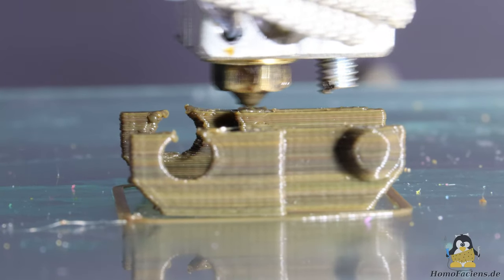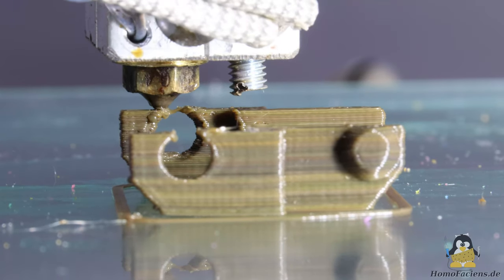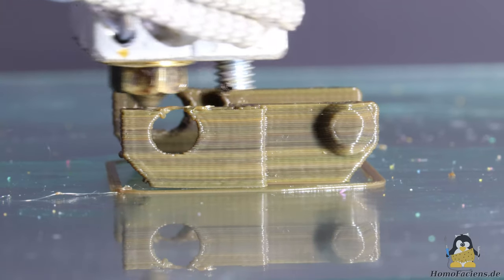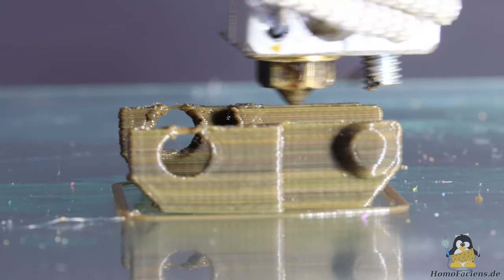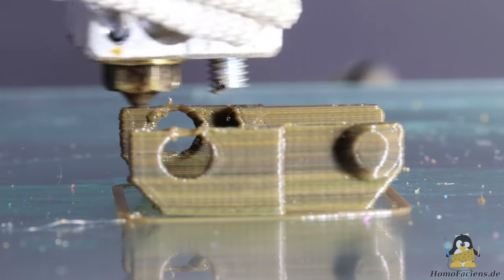The relatively soft plastic parts of my extruder are also helpful at the moment. You can see from the retract behavior whether the new extruder really works with lower forces, and that is obviously true for this iteration. The unwanted knobs at retract have become significantly smaller.